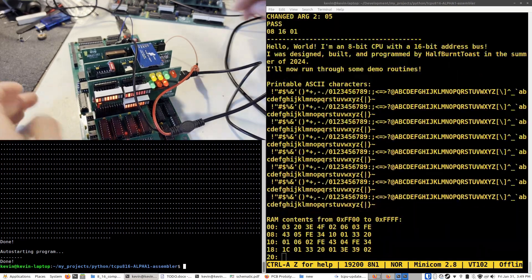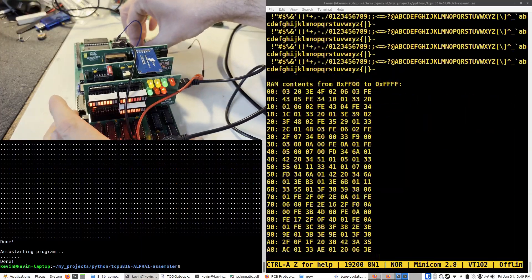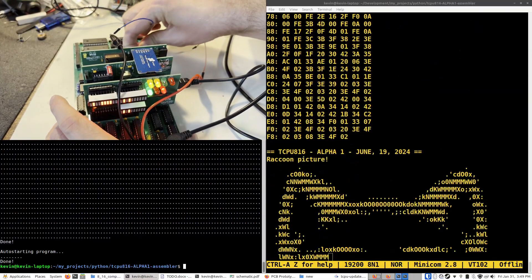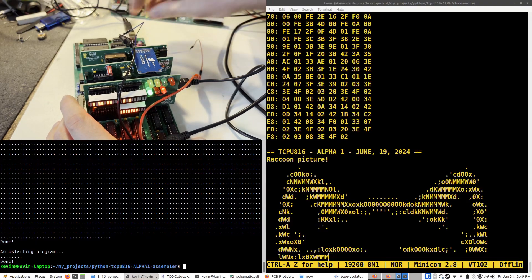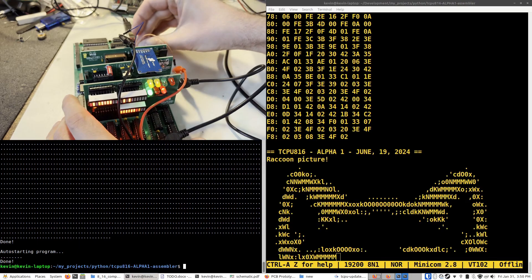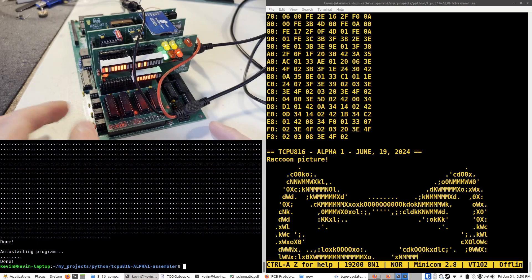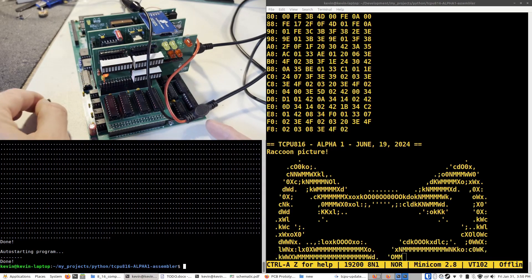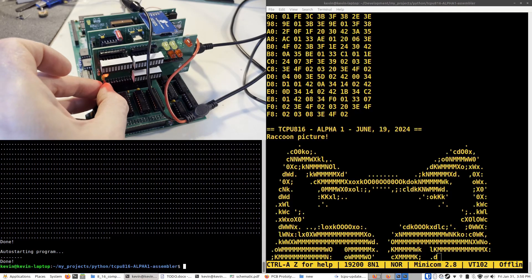And this computer is fully static. So I can attach a separate clock. I'll attach my function generator here. First I'll remove the clock selecting jumper here — so that stops the CPU. And now I plug in the external clock here. So this is running quite a lot slower. And this does use more power, so I also have a jumper here that will disable the status lights entirely. But what's the fun of a homebrew computer without blinky lights?